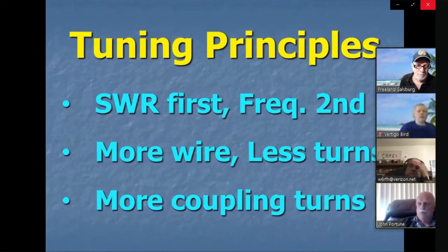How do you make more turns on this coil? Either you use more coils — put two in series — or you make the windings half as wide. At least half an inch spacing will work fine. It's still equivalent to quarter-inch copper tubing as far as the antenna goes. So if you want to go down in frequency to 80 meters, use half-inch tape with half-inch spacing and you'll need more coupling turns on the coupling loop. These are the variables you'll run into. Adapt this coil to any frequency you want.